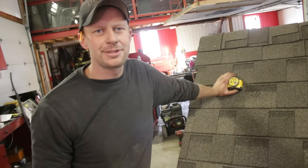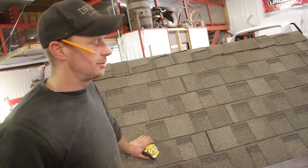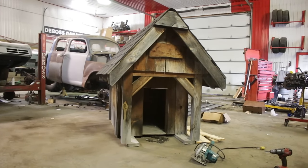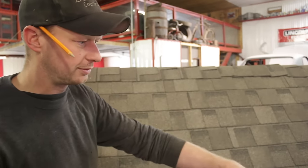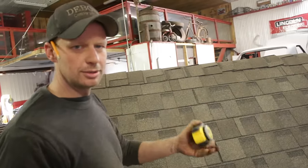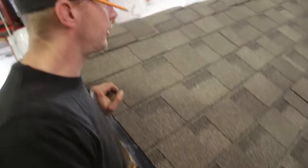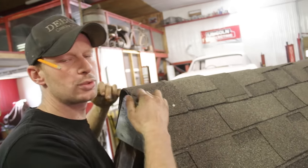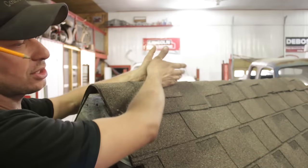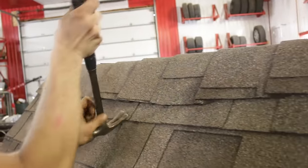We're inside because it's cold outside and I couldn't convince Aaron to join me on the roof because it's a little too steep. We're going to finish off by going over this doghouse — it doesn't need it but we're going to put the leftover cover sheets on it and explain in detail how to do the tin roofing. We've trimmed the overhang off the shingles. We're also going to have to remove our ridge cap because most of the steel is going to have a vented ridge — either individual vented sections or the entire ridge is vented.